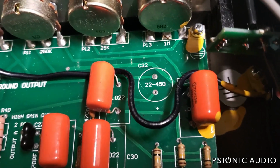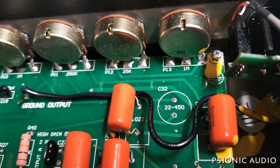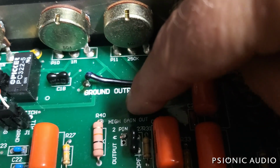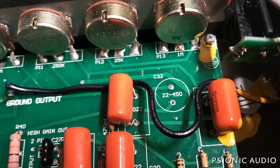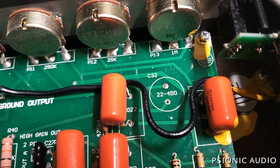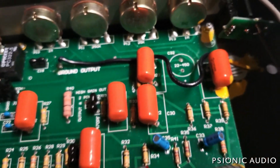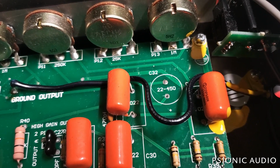And there at this capacitor here, some fugly looking solder joints there. So I'll reflow those. And this cap is going to be replaced on the board here, because there's a ground connection at the same point where that is. I might be able to get that top side with a little bit of excess, but I don't like doing that. I like having mechanical support. So, you know, again, I prefer to pull this entire thing out and do it properly, but budget's always a consideration on these things, and the owner already spent for all new tubes.